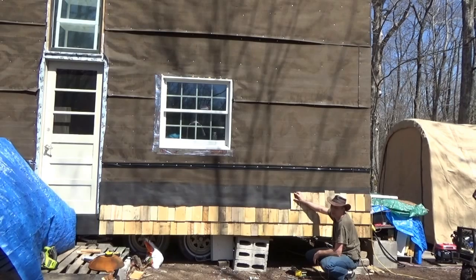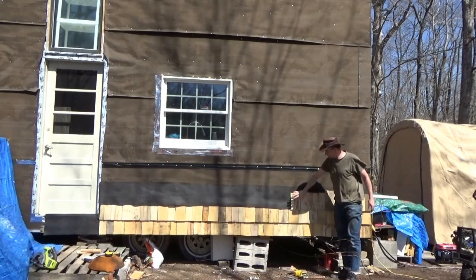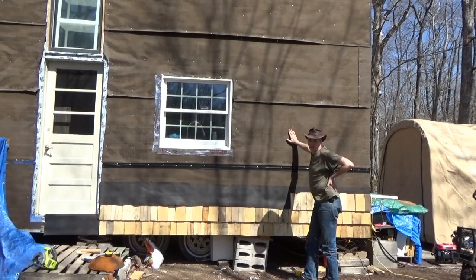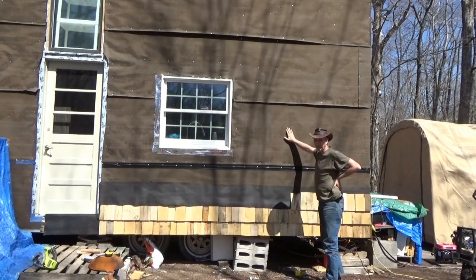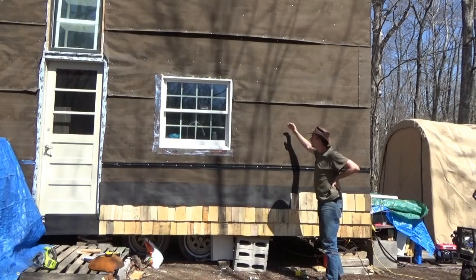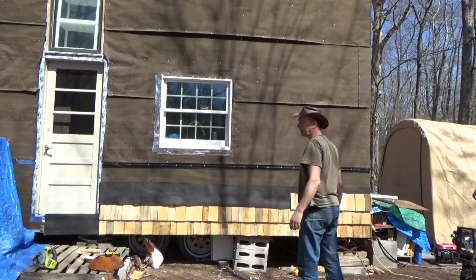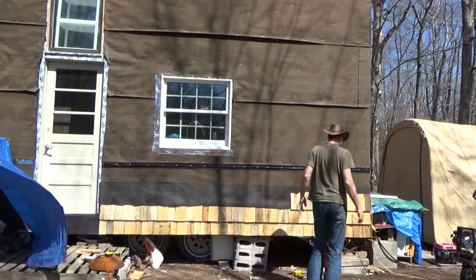It would eventually dry out and get brittle and deteriorate. But with it underneath multiple layers of tar paper plus the shingles, this tar paper will outlive me. And then the exterior grade sheathing underneath could withstand the weather, the elements, on its own. So I've got multiple layers of waterproofing protection. I have no doubt that this is gonna be fine. It's gonna last throughout the seasons.